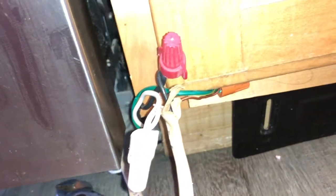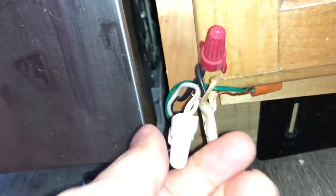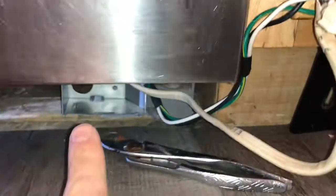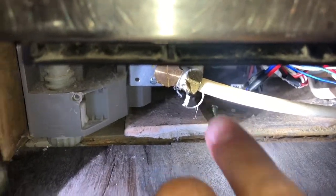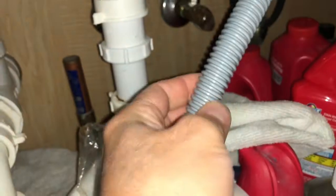The electrical connection is in this box right here. I've already removed mine and turned it back on to show you guys on video — I twisted it back in. This is actually supposed to go inside the housing, behind that cover right here. Also, you're going to want to turn your water off before you unscrew that if you're pulling the whole thing out.